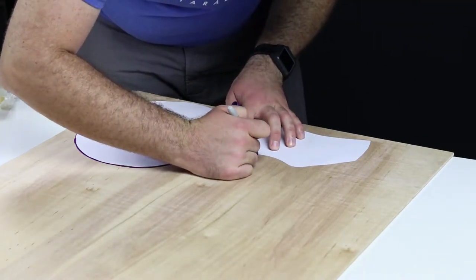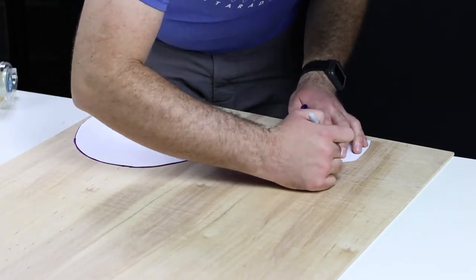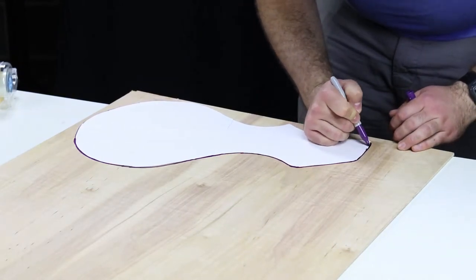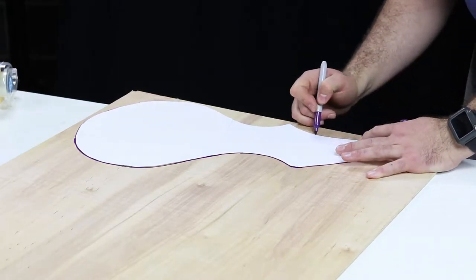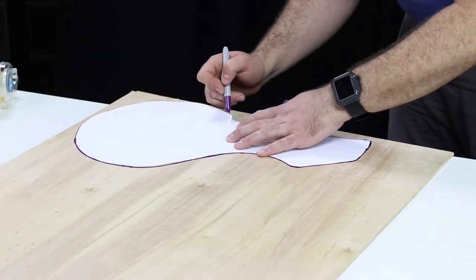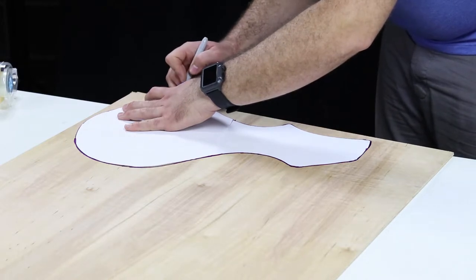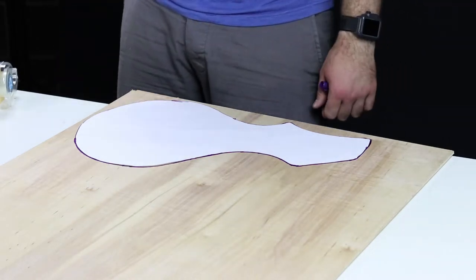It's interesting, there's like a delay, but you can see the Sharpie marker soak into the wood. Like it spreads out after it goes on. It's interesting. So you see some places I'm kind of drawing wide of the template. Not an accident. I'm just going back and making sure to hit right against the edge so that when I go back and cut, I'll know that that inside line is correct, even if it's messy and goes wide outside.